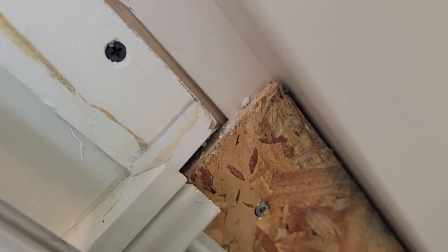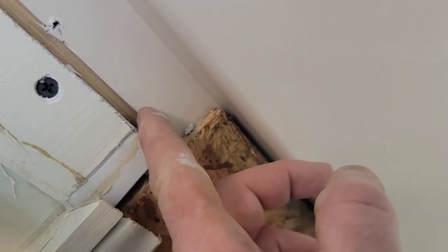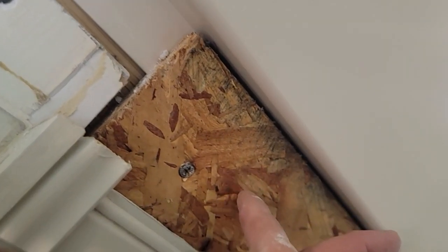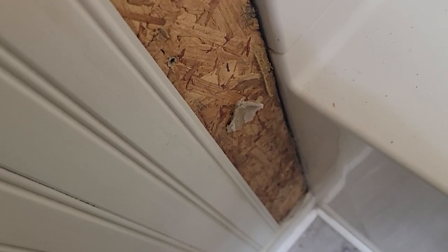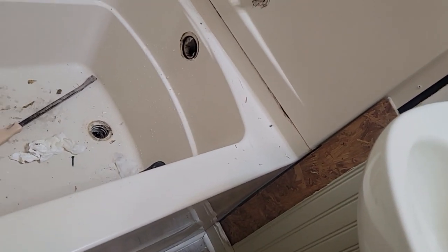So I'm going to have to get a tool and cut this. This lip is about an inch and a quarter, so I got to cut about an inch and a half down. And cut that baseboard — I doubt I can lift the tub up over it. Then I got to take that quarter round, which is probably glued on, off around the perimeter. Then I can start pulling these walls out, because right now they're trapped on both ends behind that wainscoting.